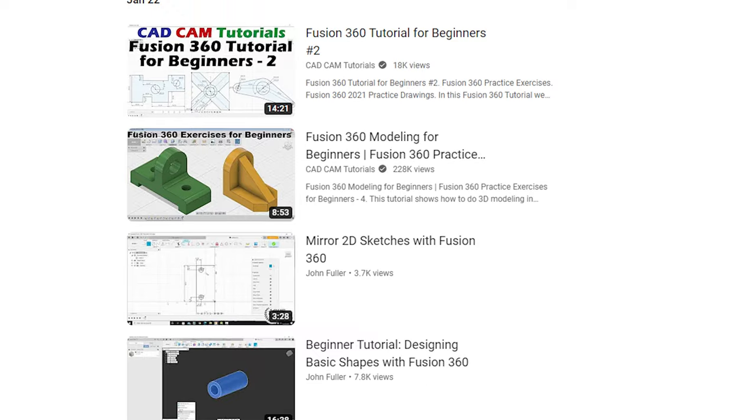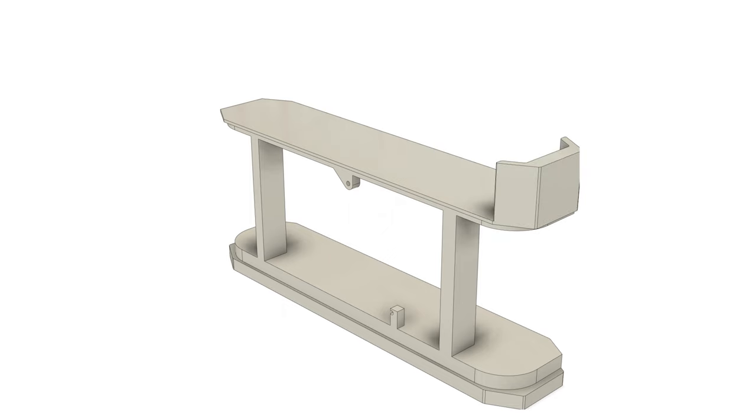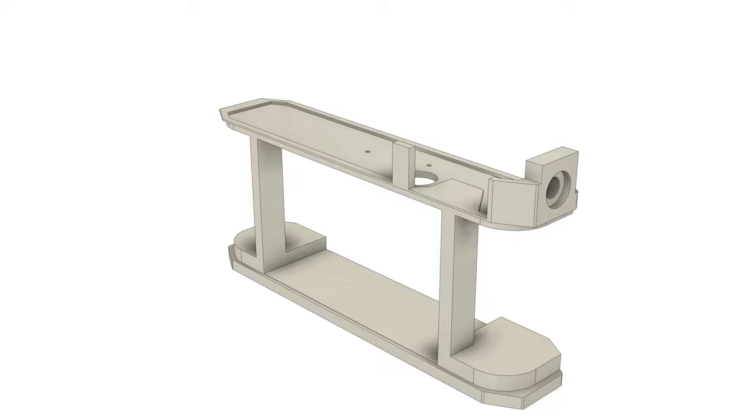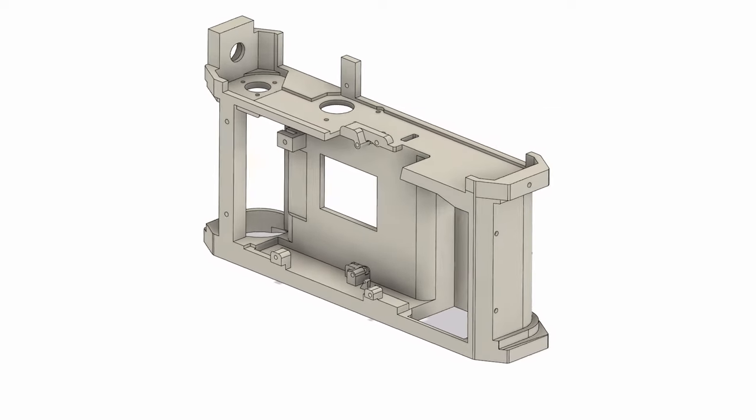I didn't even buy myself a 3D printer until I was actually ready to print something with it. The first couple of days were spent learning Fusion 360 on YouTube, following tutorials and getting comfortable until I thought I was ready to take apart the Canon. Once I had finished recreating the chassis in Fusion 360 as best I could, I moved on and bought myself a 3D printer and the NEX5. The NEX5 was very old — about 13 years — and the Canon P wasn't the best choice either because the rangefinder prism was glued in place and not removable with screws. I was able to soak it in acetone and remove it with a bit of force.